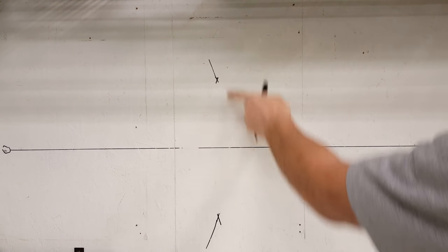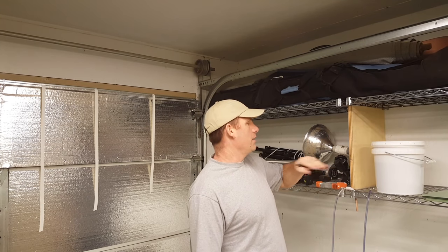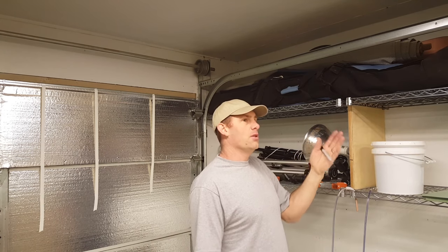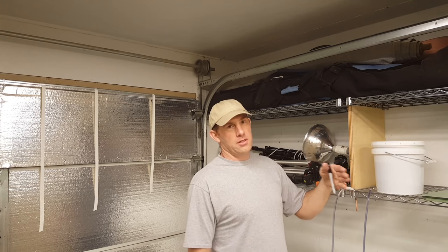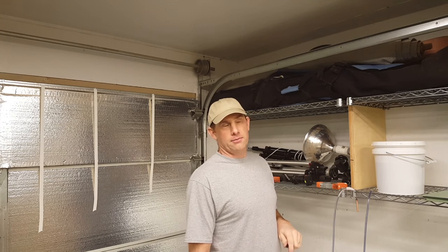So those two crosshairs, draw a line through them, and you end up with a plumb line. And you can do that anywhere you need to. So this is another way to use a water level, where you actually take the level of the water in the reservoir and match the elevation that you want to mark. And you would do this for a drop ceiling where you have a lot of obstructions and you can't use a laser because it just keeps getting blocked by those obstructions. So you can run around with the hose where you wouldn't be able to see that with the laser.